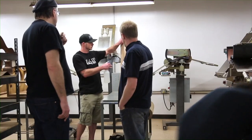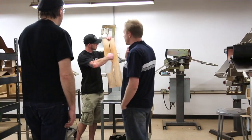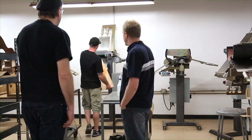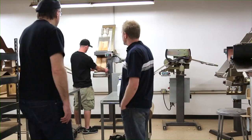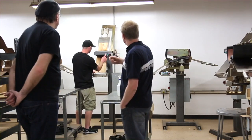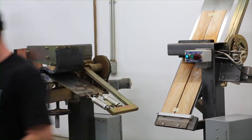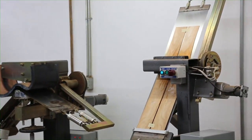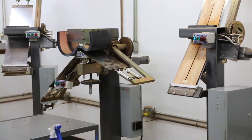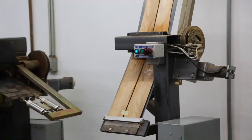Vaughn is going to go ahead and apply a little bit of moisture to a set of sides. This is standard practice — not every species of wood gets it, mostly just the species we know benefit from it. He quickly loaded it right into the bender. It locates off a little shelf on the bottom — you simply rest it right on there, and that locates the whole guitar in terms of where the waist lands. Then he hits the start button.